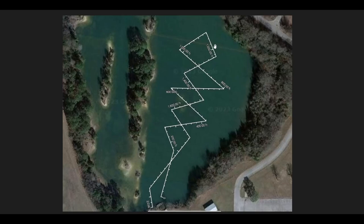This is the path I plotted for my first depth mapping test. It's a little bit arbitrary with this zigzag pattern, but I'm still testing all the navigation stuff, and I wanted to have more turns than just a straight back and forth type of path. I literally just used Google Maps and clicked on some points, took their GPS coordinates, put them in my SD card as a CSV, and plugged that into the boat. And it follows the path based on the GPS coordinates and the compass.